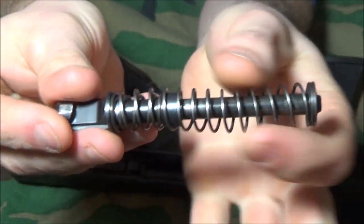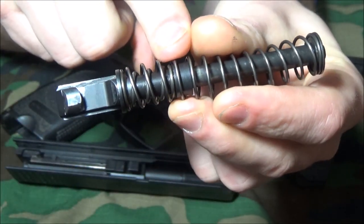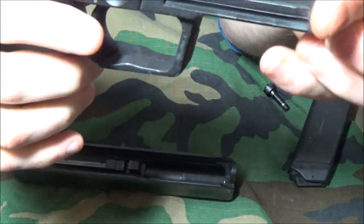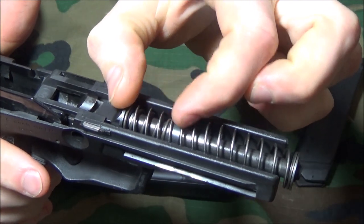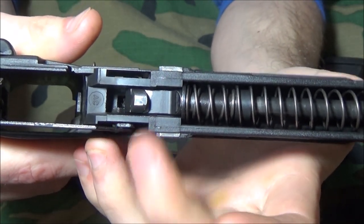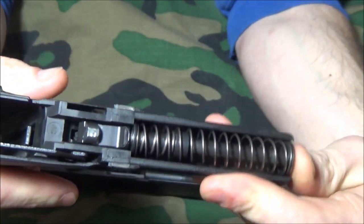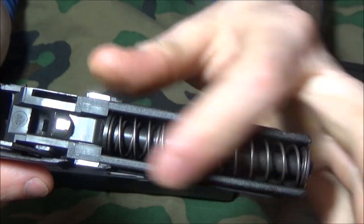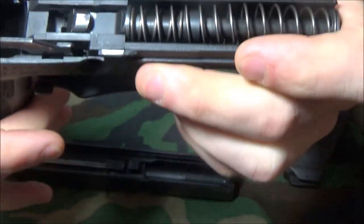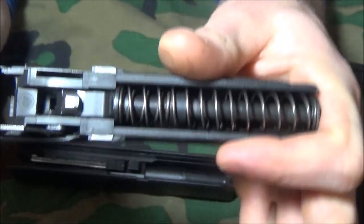With this recoil reduction system, you've got a moderate spring tension here — just enough to put it in battery with a little extra force. However, you have this extra piece here: a second spring which has a lot more weight. A lot of people think this just compresses in one direction and this part doesn't move, but the whole recoil spring assembly can actually go rearward — you can see that little bit of motion. It's a lot of pressure to get it to go rearward, and that's by design. This spring is good for both the 9mm and the .40 caliber, and you can get tactical versions for a suppressor since that kicks back more, but generally speaking this is a very easy recoiling system.